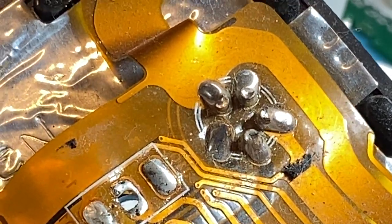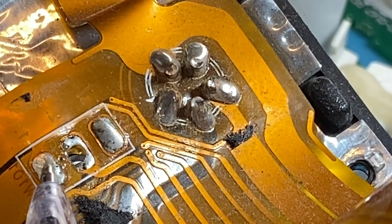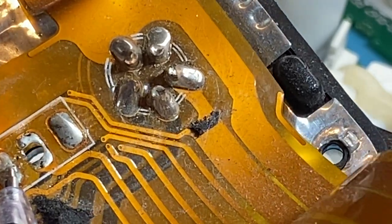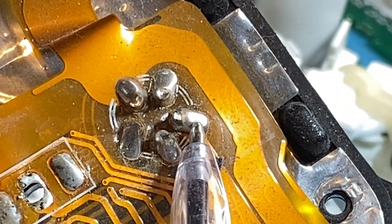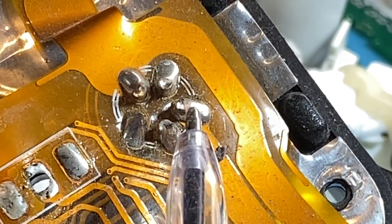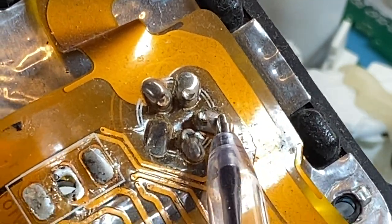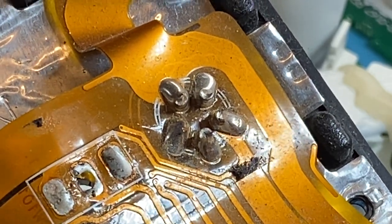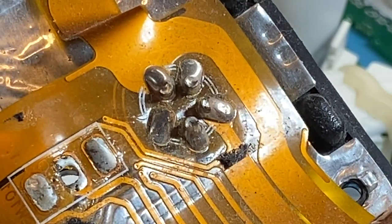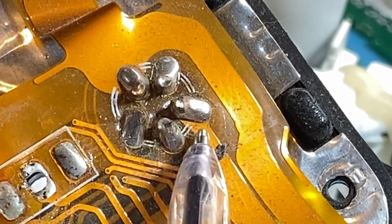What I usually do, if you have that happen out in the bush as a bush fix, solder a wire on to that point there. Normally this has your toggle switch on it. Solder a wire there, take it down, and solder it there on the positive. And now you're not relying on that mylar connection, and if you turn the thing on and off, it'll turn on and off. So just insulated wire, bang on there, stick it on there. There's a bush fix. Your detector will now turn on if that was the problem. It does break. It has broken many times on these things.